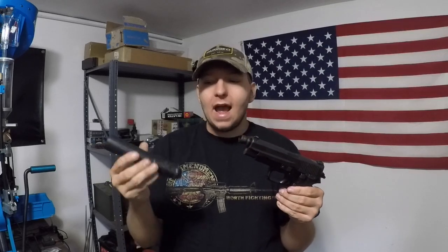But you buy the piston and then you buy these barrel mounts, and they're basically like a little muzzle device for your pistol. The cool thing about these is it utilizes a taper system with coarse threads, and then you have 3/4 inch wrench flats. So you can tighten this down with a 3/4 inch socket. Griffin recommends torquing this to about 20 inch pounds. That way it stays on there pretty good. After you do all that stuff, you basically put it on, it rotates about a quarter turn, and it's on there. That's as simple as it is.